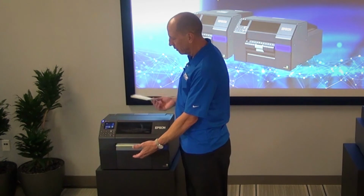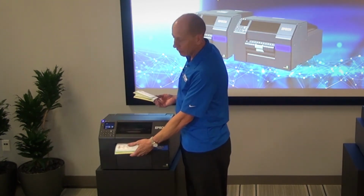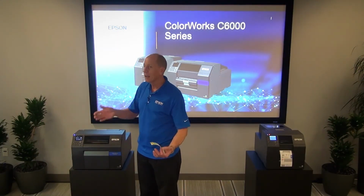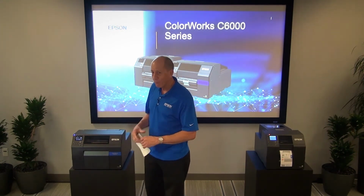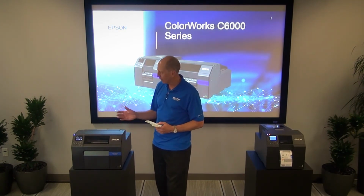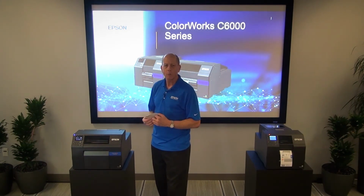It has not peeled it. It's going to cut it again, and it will cut. At this time I've printed 3 labels. But had I wanted to, I could have let it do the entire job, print through the 3 labels or whatever the number was, and cut at the end. And by the way, I could disable the cutter completely. And finally, I could actually put continuous media in here and cut to size so that I can have a variable length. So the cutter is a great feature demonstrating the real breadth of capabilities we bring to the market with the C6000 family.